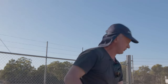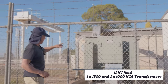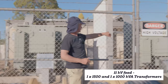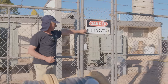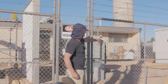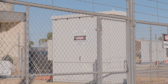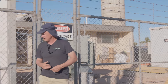It is being connected to two transformers — the first one being a 1500 kVA transformer and the second one slightly smaller at 1000 kVA. Obviously correct signage for this area and demarcation. Over here is the main switchboard, and as you can probably see, 11kV — so there's signage there that matches with the actual feed from the HV.